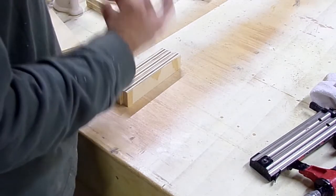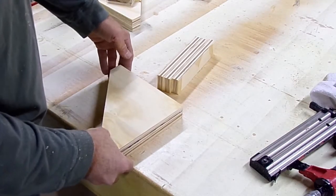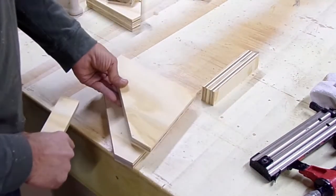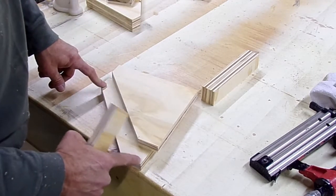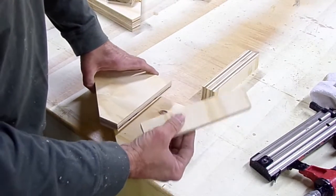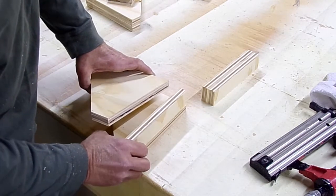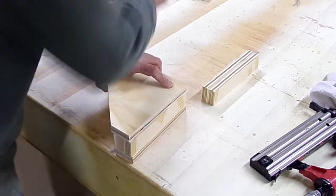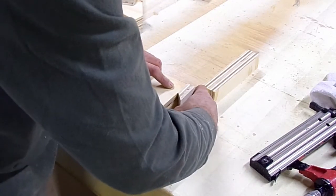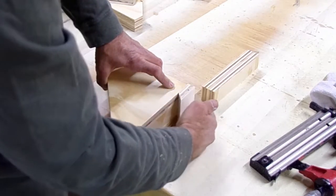Okay, these clamps are really easy to put together. Just make note that when you do put these together, after you do all your cuts, your long point here would be your bottom edge on your clamp. Just make sure that your spacer actually goes on that side and not the other. So it'll basically go on like this. And then your piece on the back, the other side of your French cleat on the back.